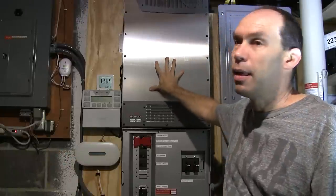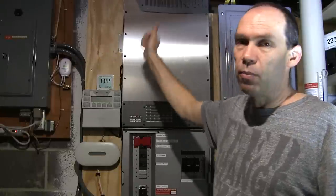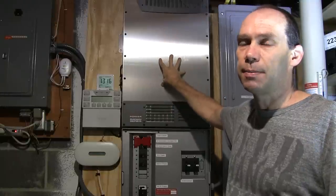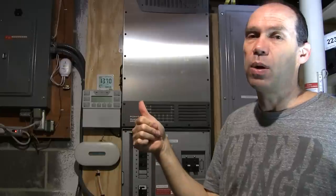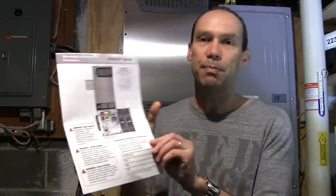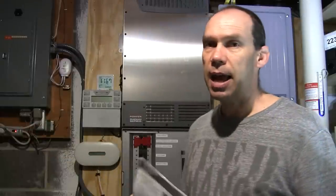The first thing I want to highlight is addressing the shutdown of systems like this one, because this caught me a little off guard. This inverter is connected to both our main electrical system — it's a hybrid grid-connected system — and it can source power from solar and from a battery bank below. So there are various electrical systems I need to be aware of to ensure this is de-energized. De-energizing this is not just a case of flicking off one switch; there are several breaker switches to consider. Fortunately, I had the shutdown procedure document for this Radian inverter close at hand.